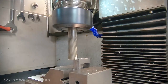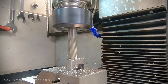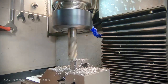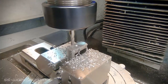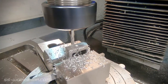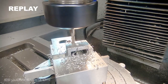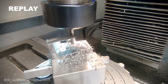The next step is to remove the waste material from the top of the part. With the waste material gone, the part's at size, so it's time to cut the circular feature on top of the part. For this I'm using the rotary table and I've offset the table for the radius I need. Well, that didn't work — obviously the part wasn't fixed down well enough and it pulled out of the vise. Unfortunately it damaged the part, so I had to make another one.